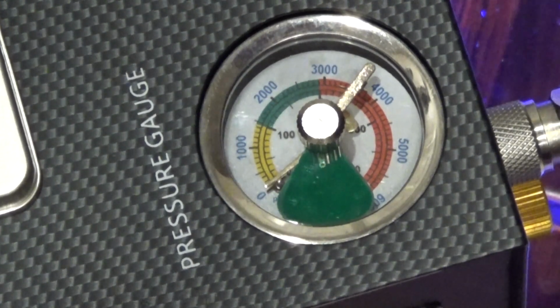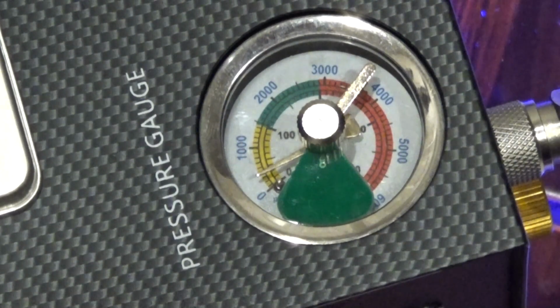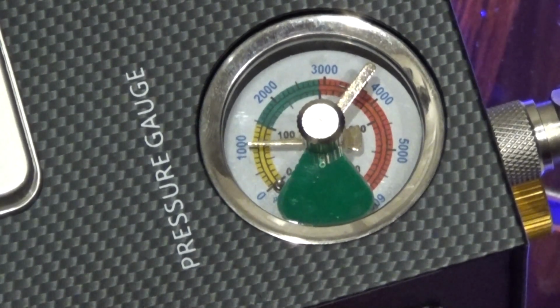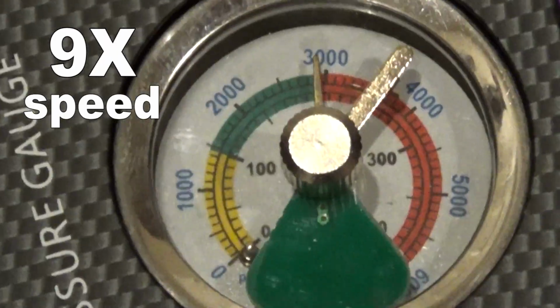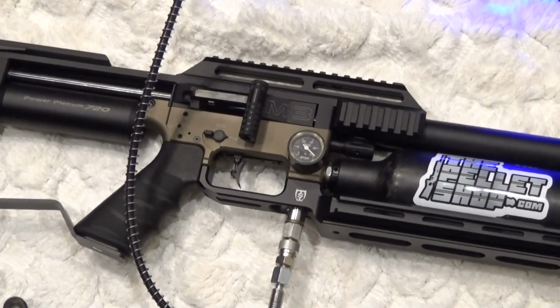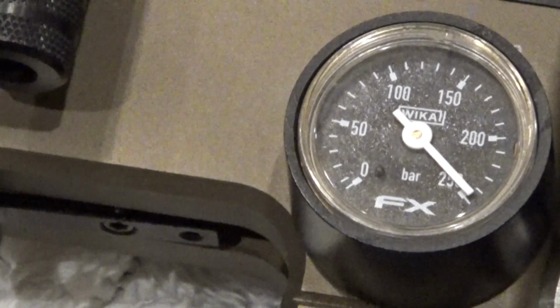Before you actually turn the compressor on, you want to open your bleed valve so that you're turning the compressor on with no pressure. Then you hit the compressor on button. You'll hear it start pumping. At that point, you're going to close your valve. Now at the end, of course, before you unplug your gun, you're going to want to do that bleed screw, and that lets all the pressure out of your compressor, and then you're free to pull your hose out of the gun.